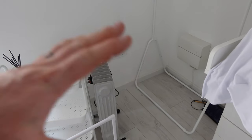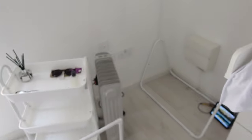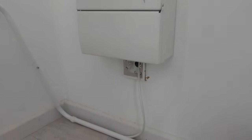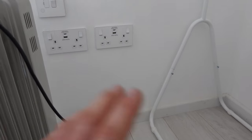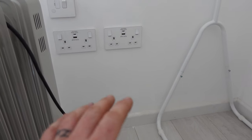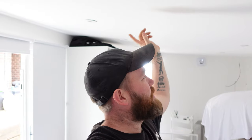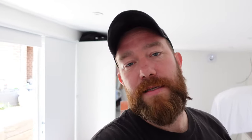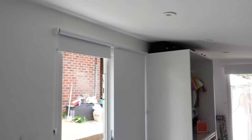Now that we've looked at the products, let's get measuring and cutting. This corner is going to be my desk area — the fuse board will be hidden, and below it we've cut out a single fast-fix box as the spur for the speaker. The sub will sit under the desk, nice and hidden. The ceiling speaker will be mounted in the middle of these two spotlights, which is also closest to the center of the room.